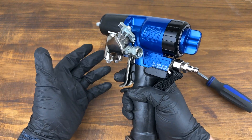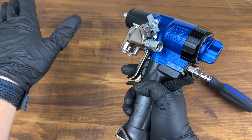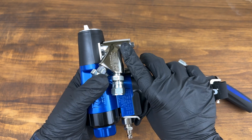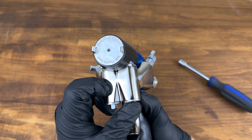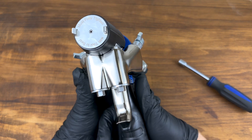For example, if you're spraying a big open cavity, you could use a 52 or something like that to get a ton of foam through. Then if you're doing a box end, rims, or something like that where you want a little less throughput, you can switch out to a smaller mixing chamber like a 42. It's just so much faster to do so, which makes you more likely to actually go ahead and change out your mixing chambers.